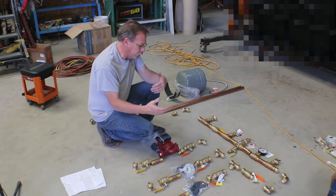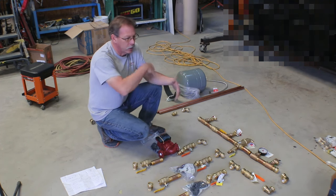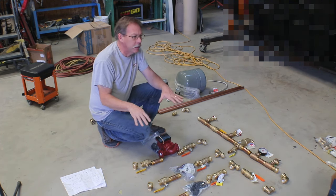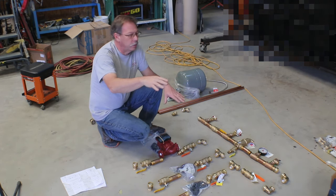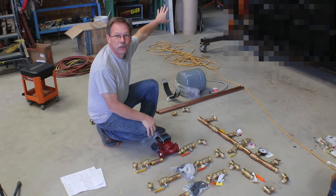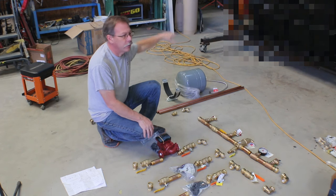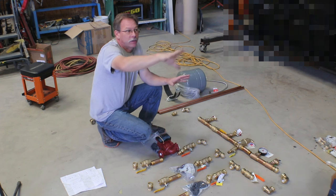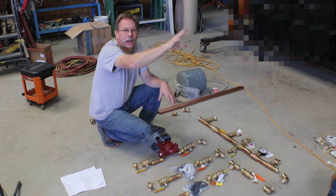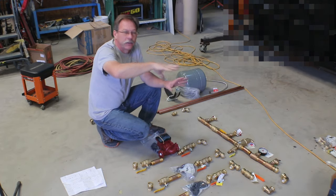Anyway, you measure this based on what's called head loss and pressure drop, and then you need to know your gallons per hour, the max flow you can get through different size tubing. All of my floors have half-inch tubing in them, and all the manifolds are connected via one-inch tubing. Right now one end of the shop has a six-circuit manifold. The other end of the shop has a four-circuit manifold. And because I still have other stuff to add to the shop, I have a third four-circuit manifold that I can add as I'm ready to bring the system online.